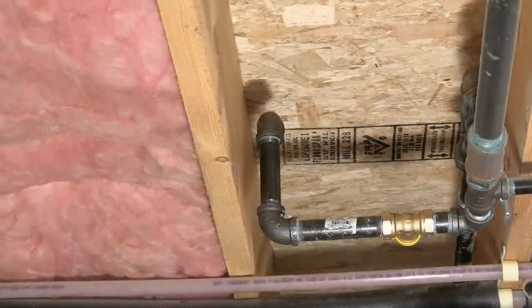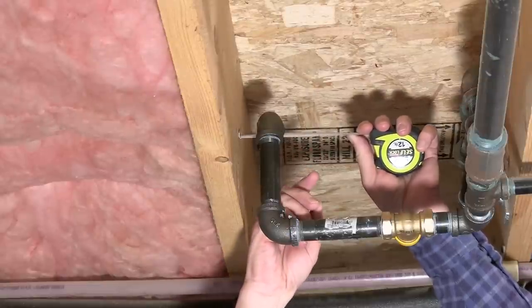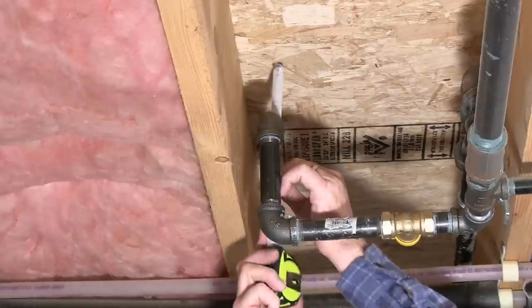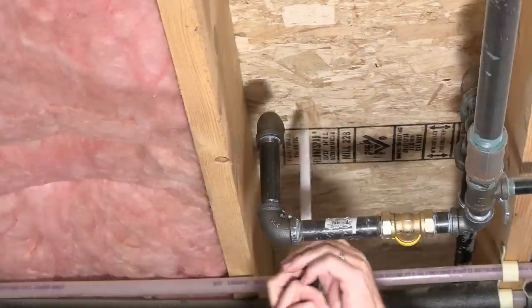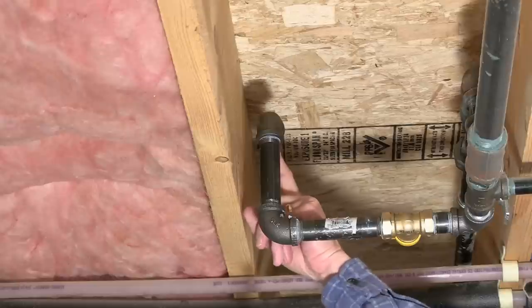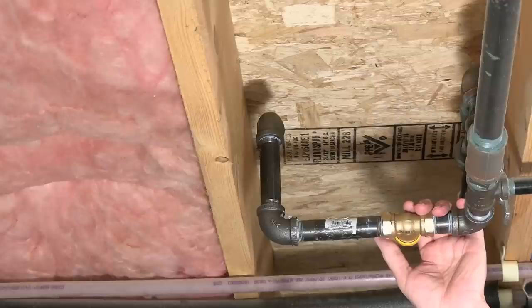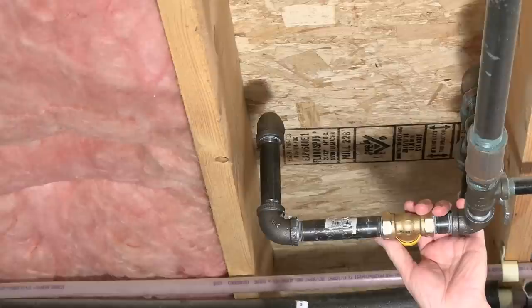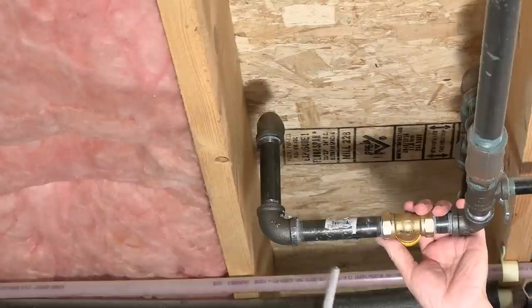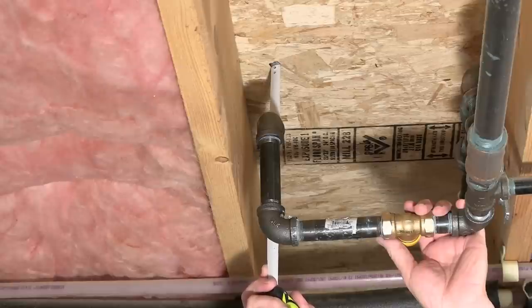We want to take two measurements — an X and a Y measurement. We want to measure to the center of this pipe: it's roughly one and seven-eighths inches, and down from the floor above it's four and a half inches, so we have one and seven-eighths by four and a half. We also have to consider that the pipe should be sloped downward since it's exiting the house — that's an invitation for water to enter. We want to maintain a slope of at least one-eighth of an inch per foot of run. With a five-foot run that's five-eighths of an inch, so instead of four and a half inches from the floor, I'm going to use five and an eighth inches to give the appropriate pitch.